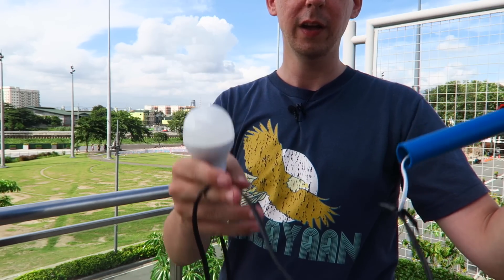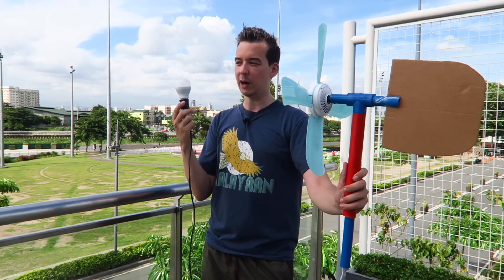As for the wiring, all I've done is added some additional wire so that it's longer, but this is the output directly from the fan — the ceiling fan — without any kind of regulation. So the output is somewhere between 100 and 200 volts AC, so it is high voltage, so you have to be careful when you're working with this. The intention is actually to regulate the electricity and to store it in a battery.